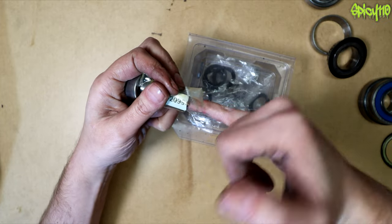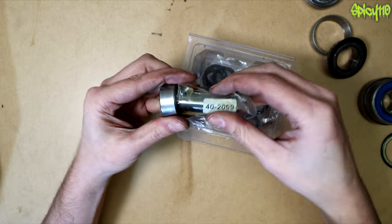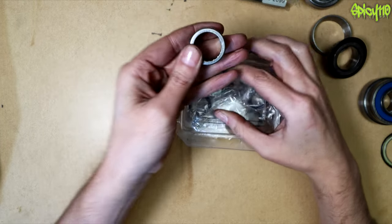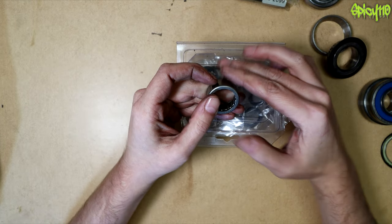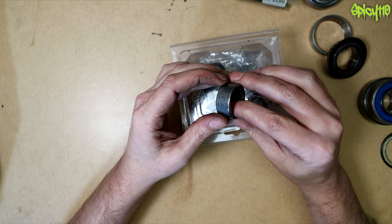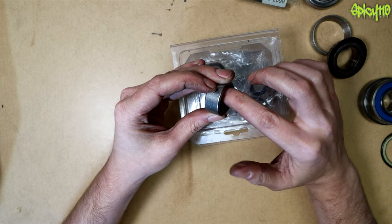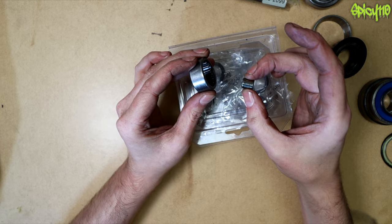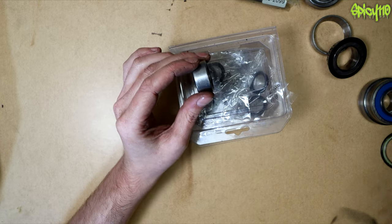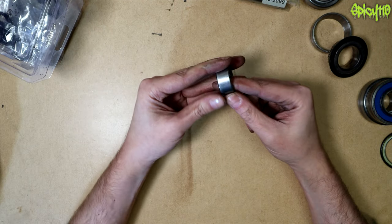There's no friction on the inner axle as such, since it'll be pinned from either end, meaning you end up pivoting the outer on the inner. In the swing arm application it's going up and down with quite a bit of force — and these can take a lot of force because they have a large surface area, though not as much as something big and thick. That's where different sizes and applications come in, which gets more complicated than we need for motorcycles.